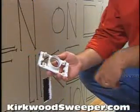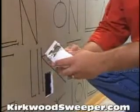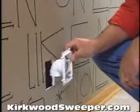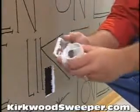Now it's time for some fittings. Make sure the open end faces the direction it will eventually meet the tubing, usually straight down. If your tubing has to run from the attic, remember that the opening of the 90-degree fitting will have to face upward.